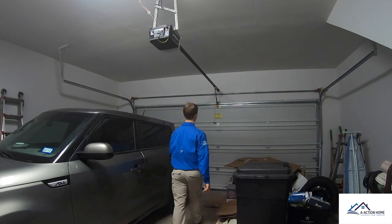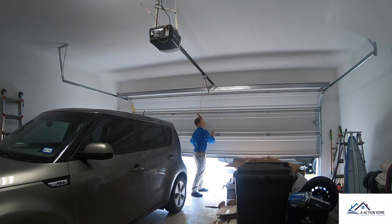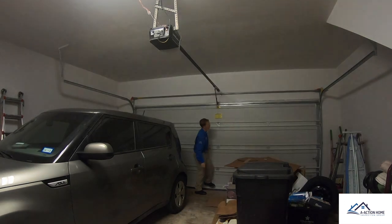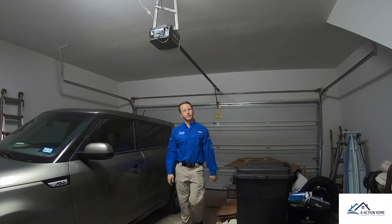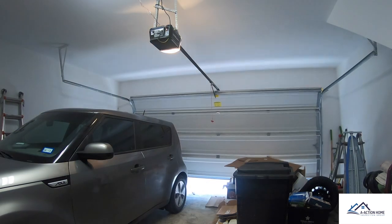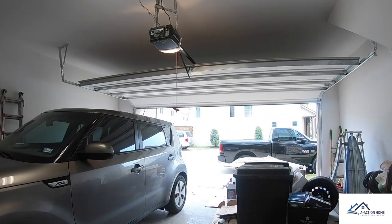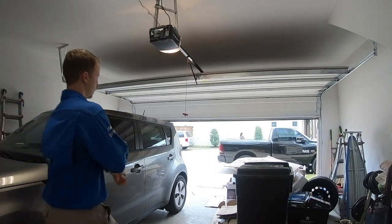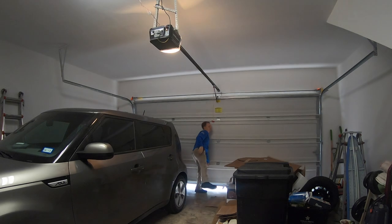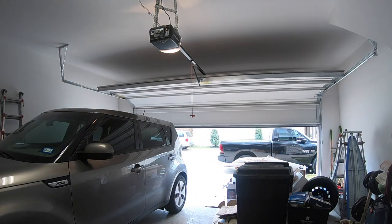The first thing I always do is I disconnect it. Then we turn it on. What I'm doing here is letting the door come down. You want to make sure the top panel comes across the bend — that's what I'm pointing out right there. That's when you want to test the resistance. If you test it in any other spot, you will damage the door. The final step is always position yourself in line with the cord so you can shut it off.